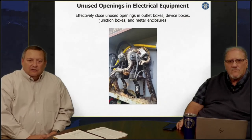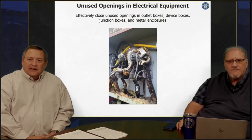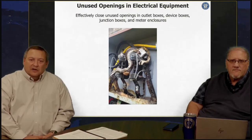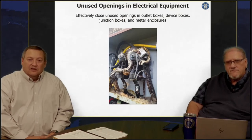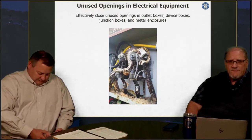This is another instance where a snake has gotten into the box, came up through the opening down there and into it — the utility had to respond to this. If there was substantial damage, they can't put the service back in service until an electrician comes in and makes changes. It's all dependent on your utility company. Some utility companies may say it's their responsibility to maintain that meter enclosure; a lot of them say it's the homeowner's responsibility and give you specifications as to what you need to install there. Each AHJ, each jurisdiction is going to have to tell you who actually has control of the equipment and is going to repair or replace it. In this particular case, the snake got across the two phases and caused some issues.